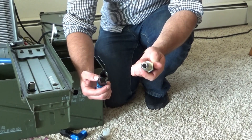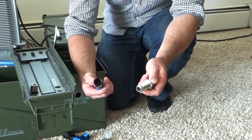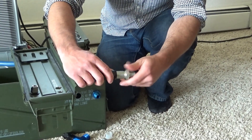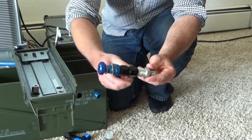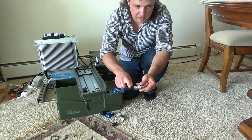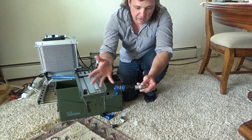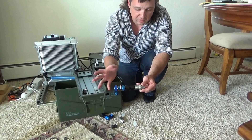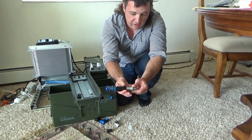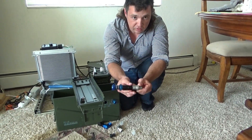You can buy these at any hydraulic supply shop — there are lots of places online. They're actually a little less expensive than the aluminum ones and are dimensionally identical. You should use the same kind: steel fittings with steel fittings, aluminum fittings with aluminum fittings. It's not generally a good idea to mix them, but you can for our purposes because we have very low pressure. Just be very careful when you tighten these not to strip the softer aluminum fittings, in case you do use them.